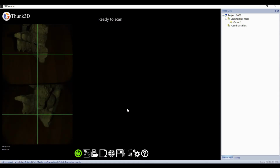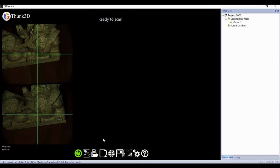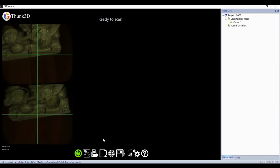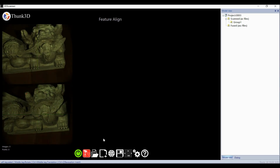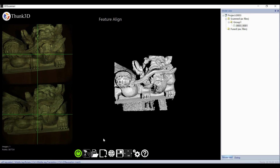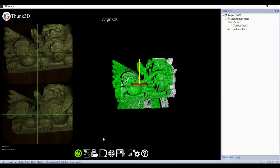There is one point I'd like to repeat again and again: the working distance from the raster to the target surface is around 49 cm, subject to the clearest cross. Please double confirm the cross; the clearer it is, the better the frame quality. Left-click the scan icon or press the space key to scan, then move the target and scan again, and so on. But please keep the target still when projecting and ensure common features for inter-scans.